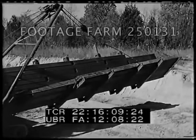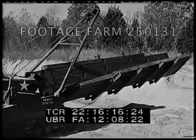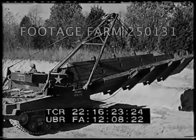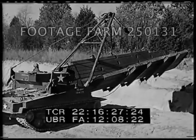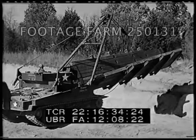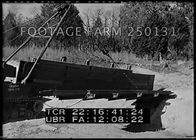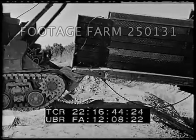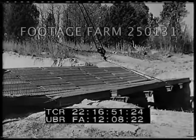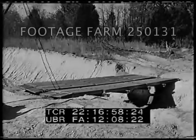Here's an expedient: the V-folded M4 balk bridge, which is constructed of standard balk and hinged in the middle. The near end of the bridge is supported on the launching vehicle. The far end is supported by carrying cable or chain formed into a free running loop to allow the bridge to unfold easily when lowered. The cable is fastened to a quick release device. After the bridge is lowered to the far bank, the launching vehicle backs up, permitting the near end to drop. As the cable is played out, the weight of the decking causes it to unfold. Then the cable is released. The bridge is now ready for traffic.